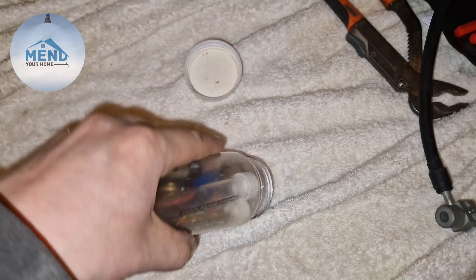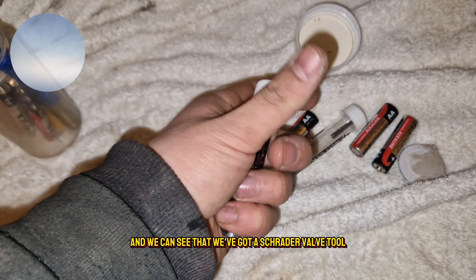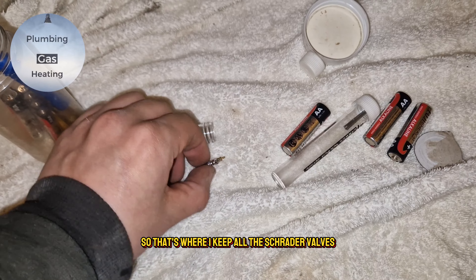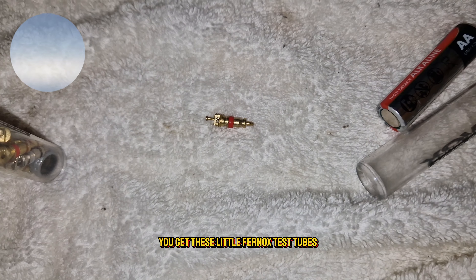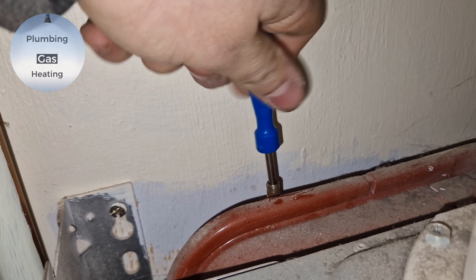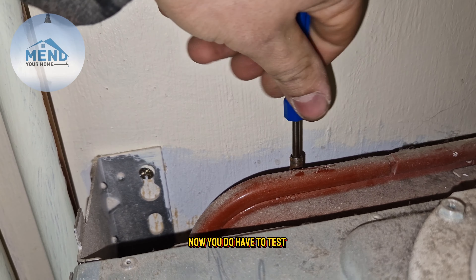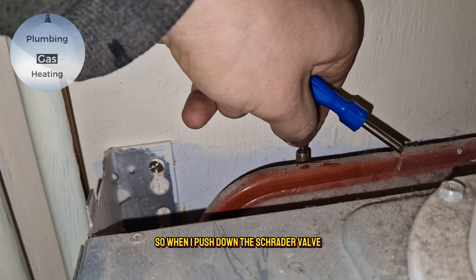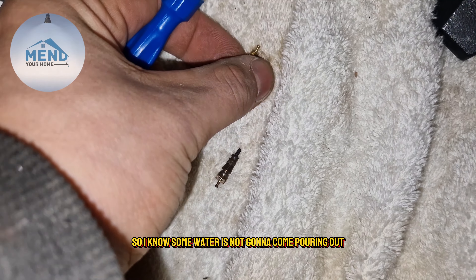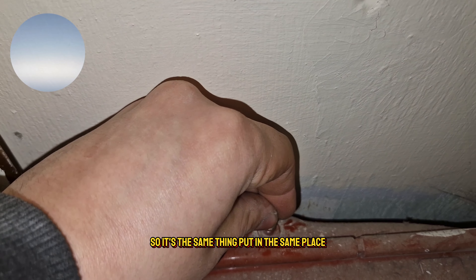You need something open when you're pumping up or recharging an expansion vessel. From my bag of tricks I've got a Schrader valve tool and the Schrader valves — I keep them in Fernox test tubes so they don't get lost. To remove it, unscrew counterclockwise. When I push down the Schrader valve I'm checking if water comes pouring out — it didn't, so I know it's fully drained down. We can replace it with a new one, screwing it back in clockwise.